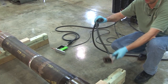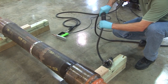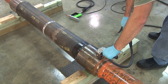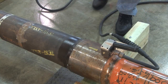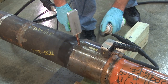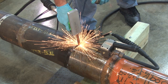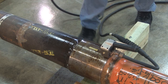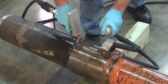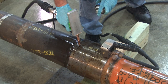In order to free the operator's one hand, the magnetic leech can be utilized. Its permanent magnet makes it possible to provide proper contact with the metal part to be tested, and it is equipped with a handle and easy-to-use either-end connector. The prod must make good contact with the part, which is tricky with round surfaces. Improper angle or unstable holding can result in sparking and possible burn marks. When performed properly, the prod and leech combo is able to provide good magnetization and locate axial indications. Changing orientation of the contact points will allow finding indications in other directions.